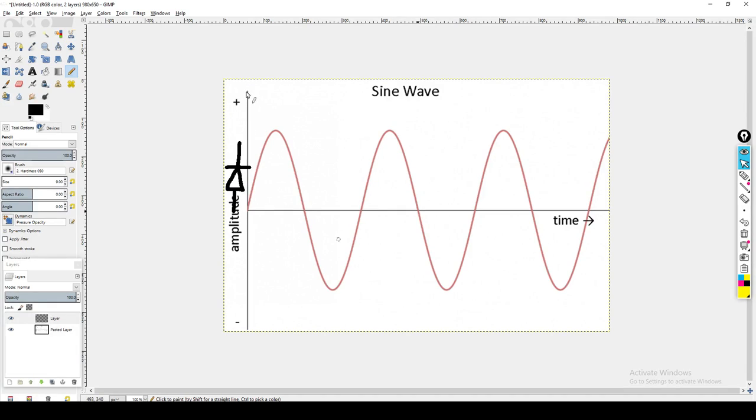So, for example, let's just say this is 1.0, and this is 0. Okay, and then obviously this would be 0.5, just for ease of use, we'll use those numbers. Okay, so let's say that our diode has a forward voltage of 0.7, so right here. That means that with this current example, this sine wave would never actually clip because this is only at about 0.6. So it would never cross over this threshold to go beyond the forward voltage point and start clipping. Well, now, instead, let's say we're at 0.3 and we're right here.